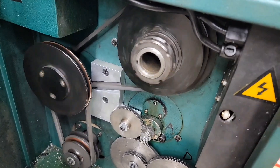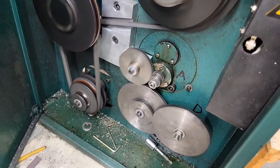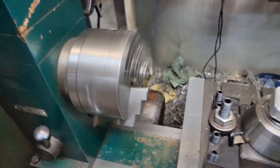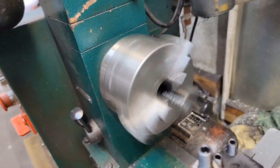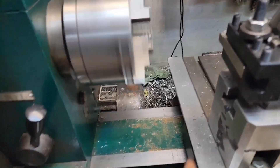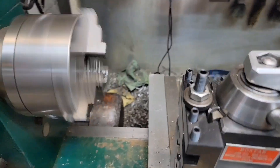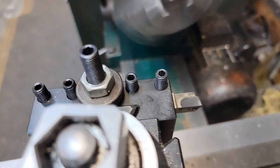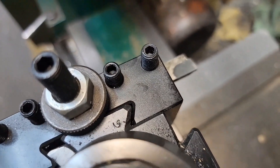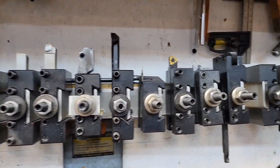If I turn it on and forward, you can see the spindle is turning clockwise from there. So I'm going to run and see it's turning - it looks like it's going the opposite direction in the camera, but it is turning normal. Engage the power feed and now we're going to cut away from the spindle. Not something you're going to use a lot, but on those rare occasions you do it will be real nice. Just because I set it up with that one in there, I realized out of all of them that is the only one I have that is a cut right.